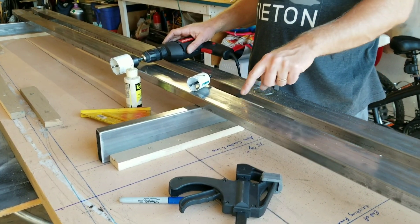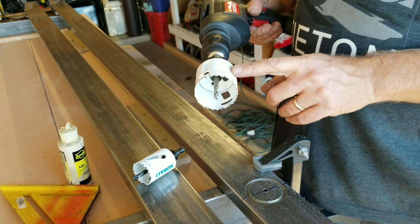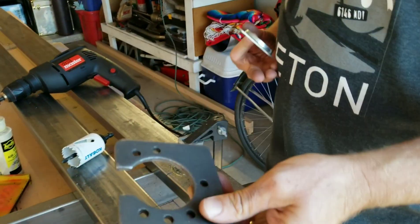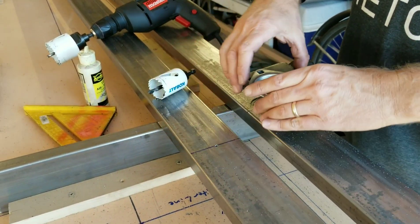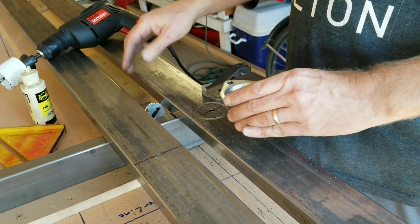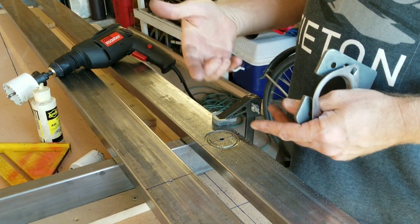Okay so we started drilling the holes. I marked them and drilled a one-eighth inch pilot hole on each side. I'm using a two and an eighth inch hole saw — two and a quarter would be perfect but two and an eighth works because I'm going to be using the outer bracket. This comes with the set; sometimes people delete this, I deleted it on mine. When I drill the hole at two and an eighth, this fits perfectly — the hole is just big enough. So this is on the outside. The inside hole, because there's not going to be a bearing on the inside, is going to get — I think this is one and a half inch. Yeah, one and a half inch on the inside. So the outside gets the bigger hole, inside gets the smaller hole.